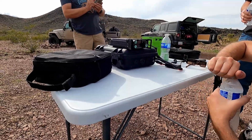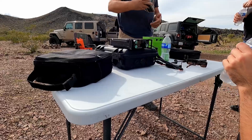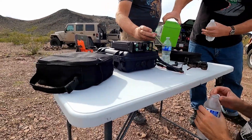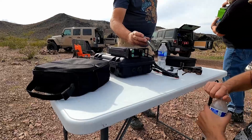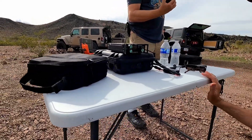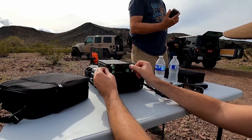So it's reading three-to-one, no tuner. This antenna you can actually use on a lot of bands even without a tuner. You may not get full power up but a lot of them are less than three-to-one, so it works pretty good.